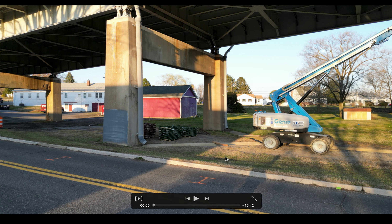Let's look at the supports here — there's a little rocker. There are two sides of the structure and the joint of that seam. Cutting to the chase, there's water damage coming across this tie beam. The loads are carried by the outside columns. This is a tie beam; it gives rigidity and stability at the upper end of this cantilevered beam. So this gives you support in that direction, and helps with some torque and torsion as the bridge gets vibrated by heavy traffic.